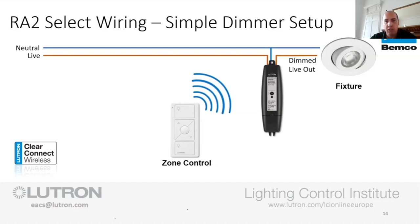Most of the time in domestic, obviously, it's type B breakers. More commercial, you're seeing type C. So does that hopefully answer your question? I know that a lot of lamp manufacturers are putting guidance on that with regard to the inrush. They were saying that there could be up to 253 times the normal running current of the lamp, so a type B could easily trip.